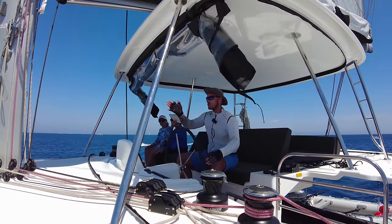So now if you wanna unfurl, we have to pull this rope, but also release this one. But when you're furling, you wanna pull this one. By pulling and releasing this rope, you're rotating this sail, either furling or unfurling. And this is the jib sheet, so-called. This rope is gonna open the sail, but when you wanna close the sail, furl it back, of course, you have to release this one and pull the black one. So when opening, you're releasing the black one, pulling this one. When closing, you release this one and you pull the black one.